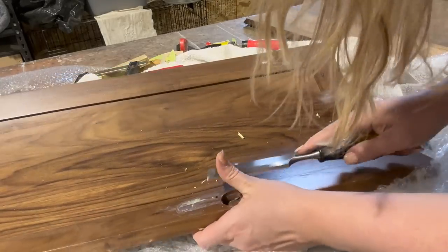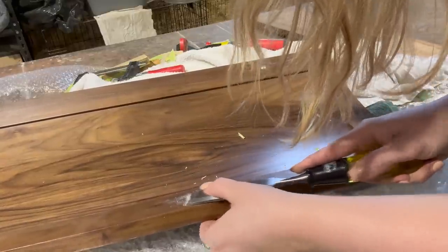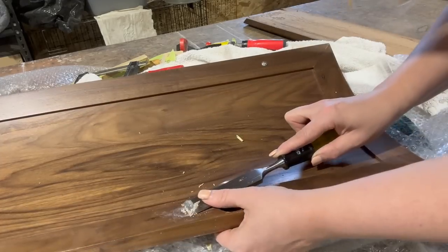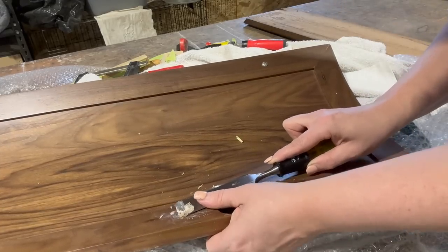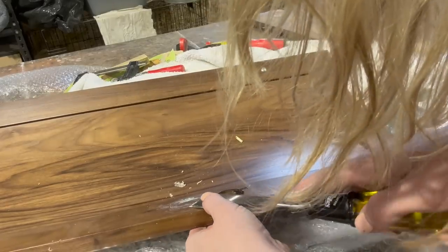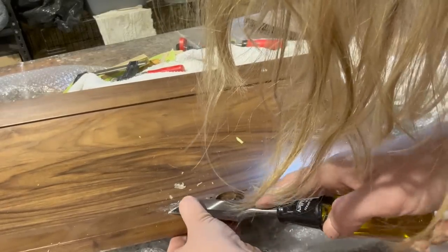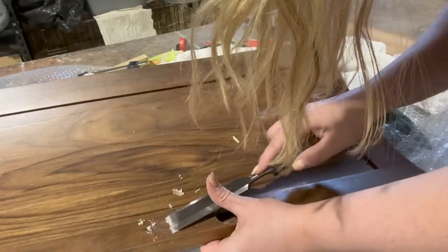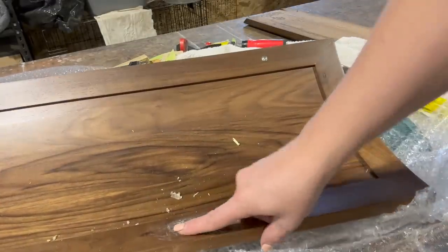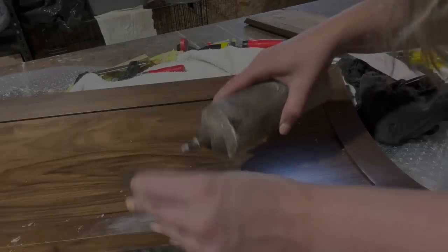Looks pretty good. Just a little bit more of the epoxy. And epoxy does flake off nicely. If there's a finish underneath it, you just gotta get right underneath it there. Good, so I'm just gonna grab some Varsol and a Scotch Brite and scrub that.